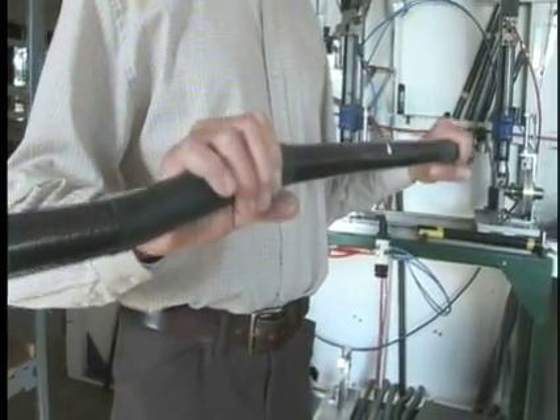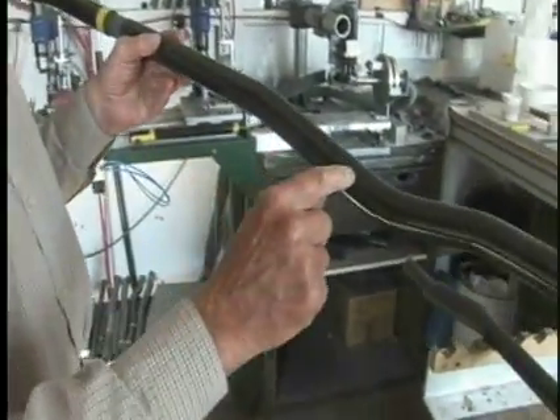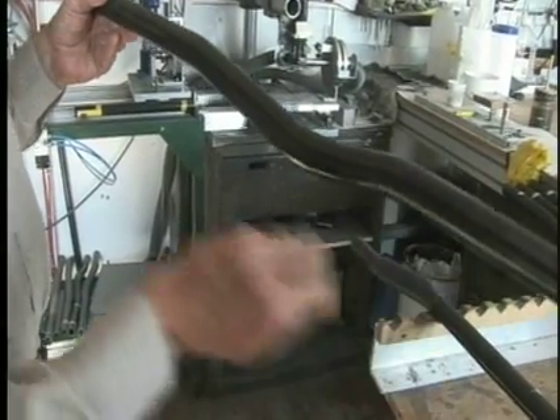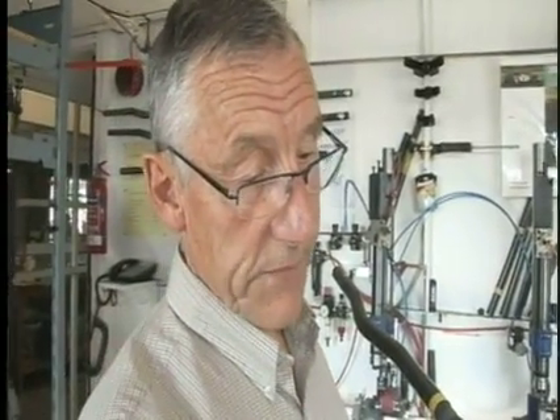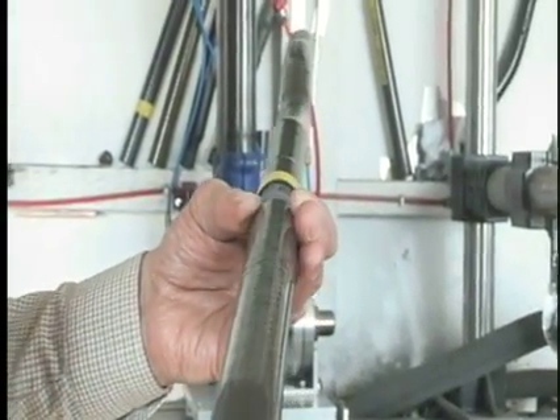So I had a little bit of a think about it and came up with what I called the modified crank, which has the first angle but then brings the shaft back into line. The advantage is that the axis of the shaft is straight so the paddle is perfectly balanced. You have the correct angle to keep the wrist straight, but you also have the big advantage of pulling slightly ahead of the centre of pressure of the blade — like the caster wheel on a chair or table, it automatically stabilises when you pull.